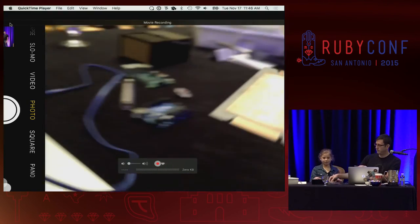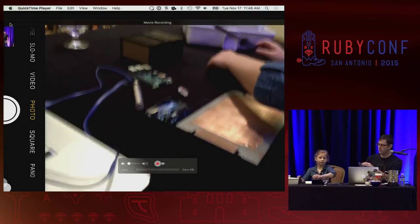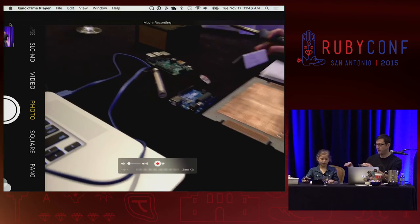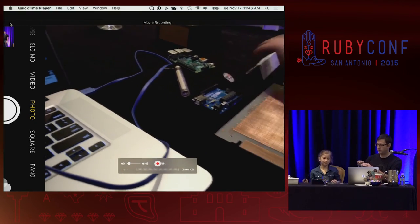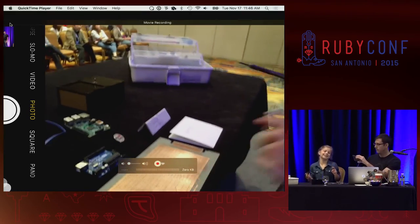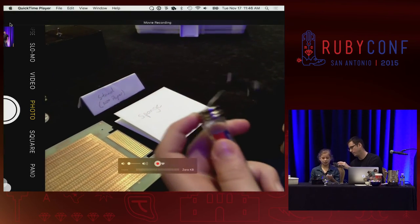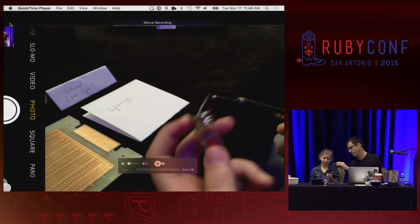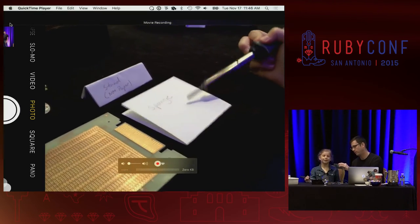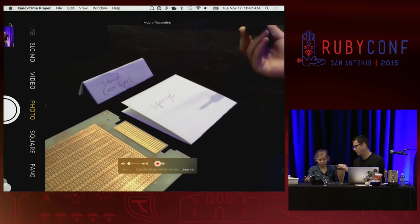I didn't quite have the guts to ask the organizers if we could have toxic metals and toxic other gas. So we're not going to actually do this, but Leah can walk through how it works. Okay. So first, you have to tin the soldering iron. So you take the solder and touch it to the tip of the soldering iron. Then you can wipe off any extra solder. Sometimes you need that off because it just doesn't want to come on.